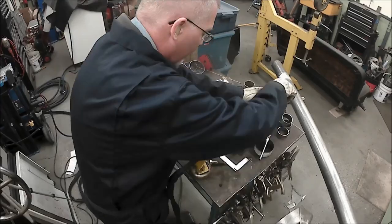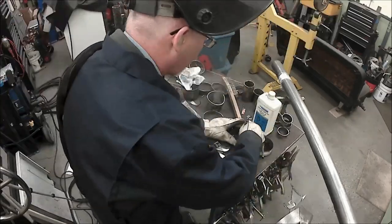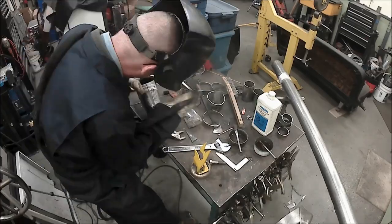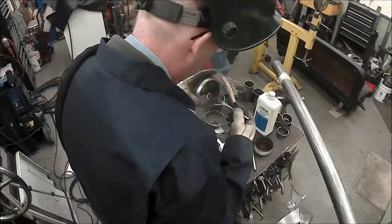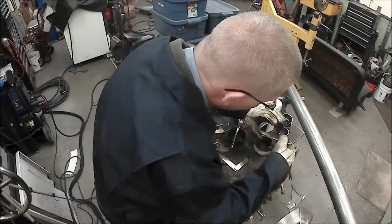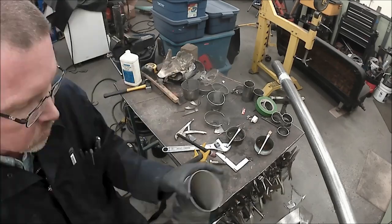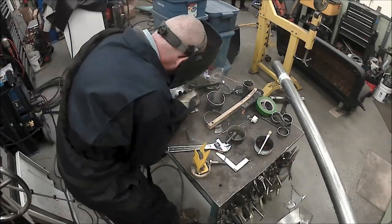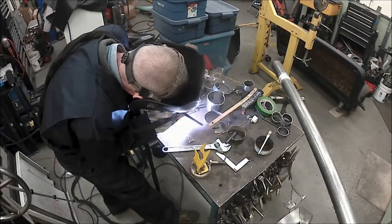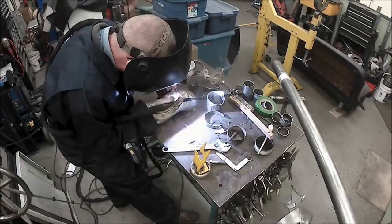On a turbo, we're using the hot pressurized exhaust to spin a turbine, and once it does its work at the turbo, we don't need anything in its way at all, and any back pressure in the exhaust system could restrict how well the turbo works. So, 4-inch. 4-inch is sweet. I was able to buy a length of 4-inch tube for not much more than a single mandrel bent U, making it turn a corner as easy as pie.